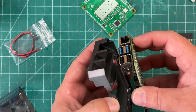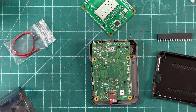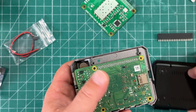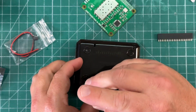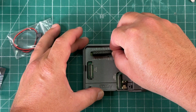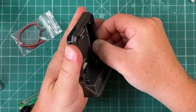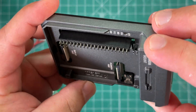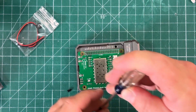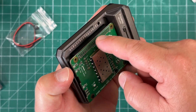Now we're going to temporarily install the Pi 4 into the case. It says to leave the plastic on if you don't want to scratch it — I don't care about that — and we're not going to put the thermal stuff on right now. We take the 40-pin GPIO extender, make sure it's firmly seated, then slide the Pi hat over the pins, screw it to the case, and solder all 40 of these pins.